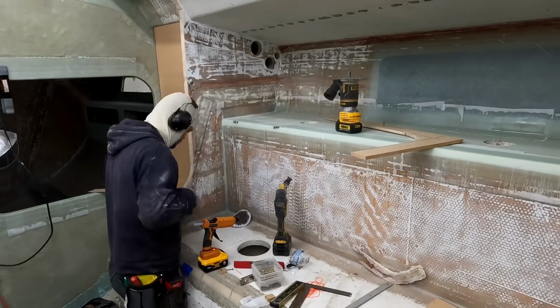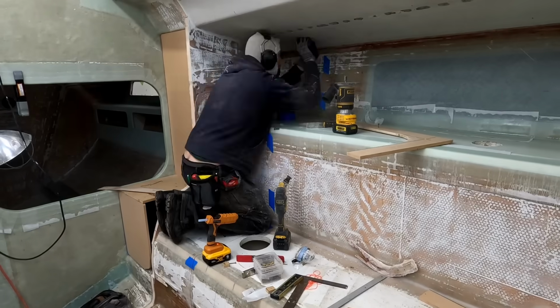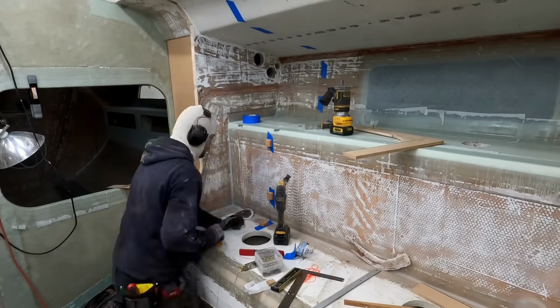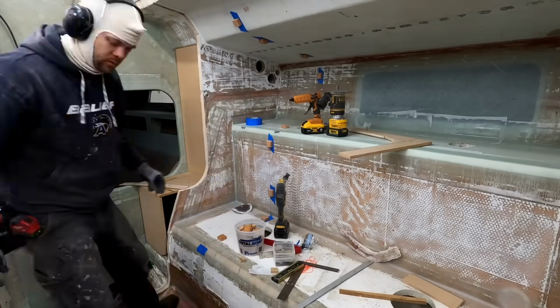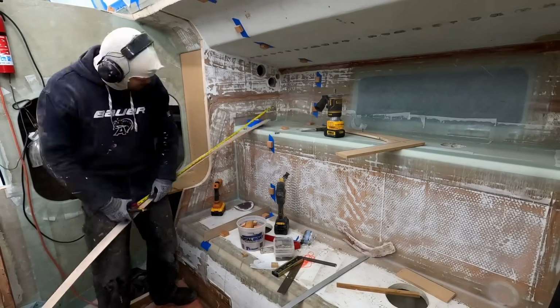As you know by now, the first step in building interior spaces is to create a template. Here I am creating a template for the Portside stateroom. I used a laser line to find where the aft edge of the bulkhead will be. The boat tapers aft here, so the part will fit better than if I used the forward face. I place the blocks along that line, which are used to hold the patterning doorskin in place.